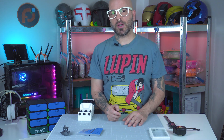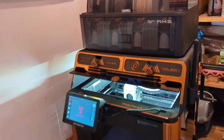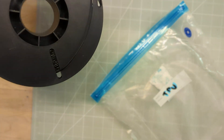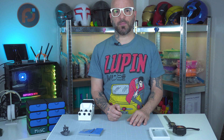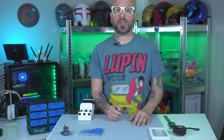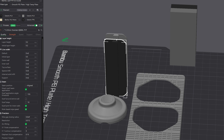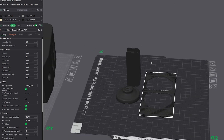Let's start with the materials. First up, TPU. It's flexible, durable and can take some serious force. For this particular build, TPU is used only for the padding. I loaded the filament into my Bambu Lab P1P and sliced it in Bambu Studio. I used this generic Amazon TPU, which works perfectly. As for the settings, I used the generic TPU profile provided in Bambu Studio, but as expected, it took longer to print due to lower speeds. And here is a timelapse.